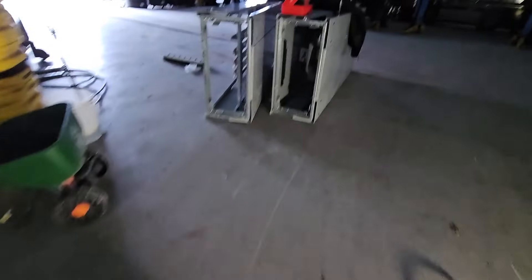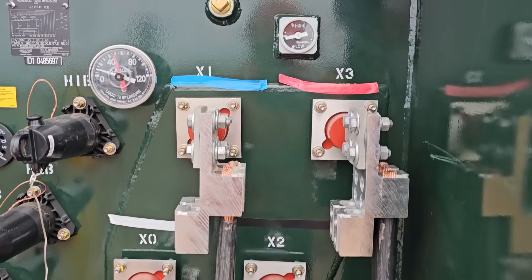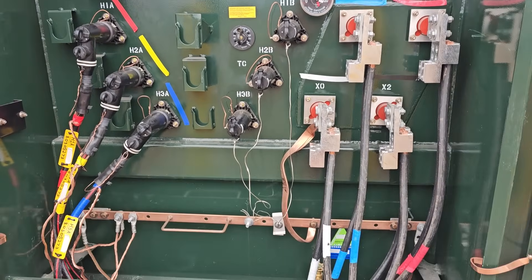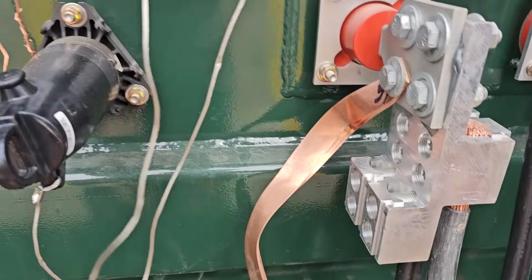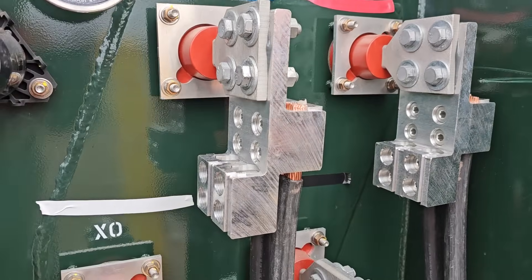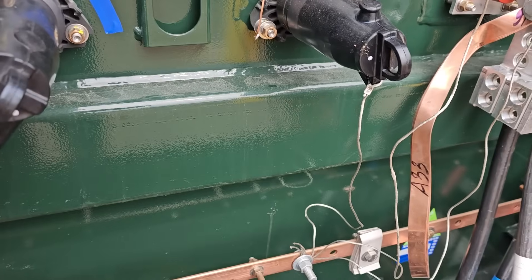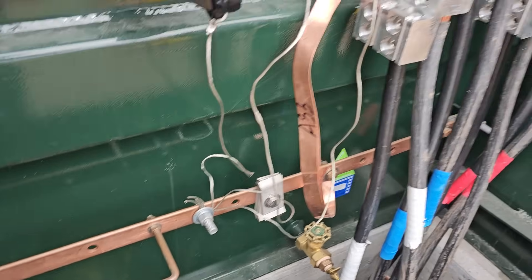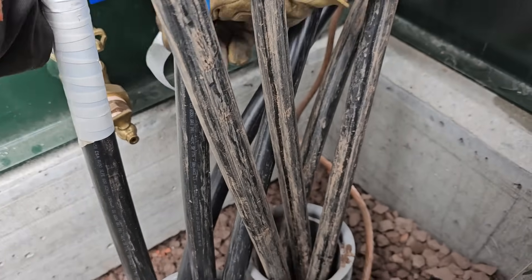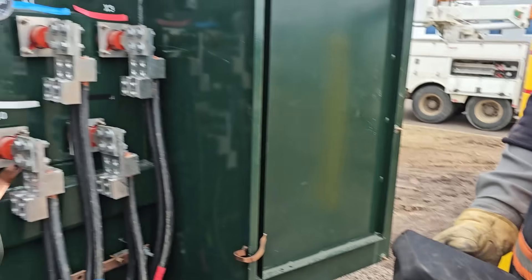There's a whole lot of tools and equipment for the electricians there; they're going to be a while yet once we're done. But our work is done here now. Just kind of checking out, making sure the boys get everything all finished up in the pad mount. Everything looks good there. So we are ready to energize up to the main breaker. They don't have all of their sub-breakers and sub-panels tied in yet, but we can energize up to the main just to do a voltage check and fire up the metering equipment. Probably the most important part at this stage - we're not going to fire that out without communicating with everyone in the building that might set foot in that electrical room. So we head off inside, let them know we're ready to go, they're going to clear out of the electrical room, and we're going to start tapping stuff on.